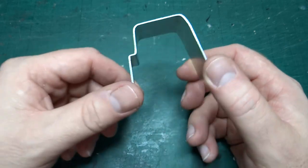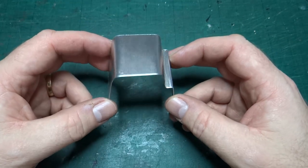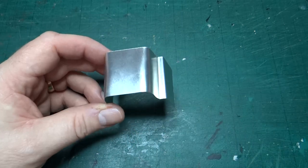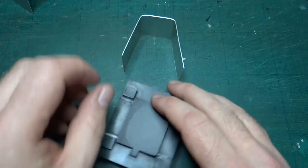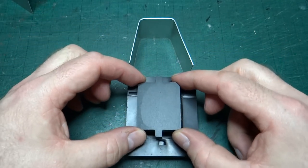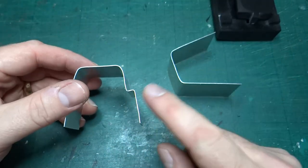Anyway, if you remember, we're trying to build this shape from sheet metal to go over the back of the loco and over the controls. And it's proving problematic, partly getting this shape right, but also these two almost 90 degree angle steps. In the last video, I got as far as being able to do this. So I printed this 3D former, which with a piece of flat metal across the top, pushing down on this using my drill press, allowed me to form this. But obviously that still leaves this 90 degree step.